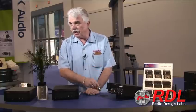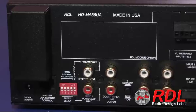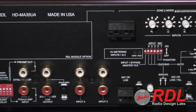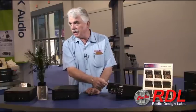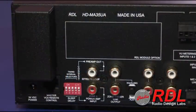There's also a terminal block on the rear that gives you a balanced line level out. Of the four inputs, the line 1 input is transformer coupled. The Zone 2 output — the 4 watt output — also has a transformer coupled 600 ohm output from that mixer. On the 70 volt model, the outputs are on a detachable terminal block located behind a tamper proof security cover. This security cover cannot be removed without removing the power from the unit, which ensures that even during the installation process you have to remove power before accessing the 70 or 100 volt output terminals.